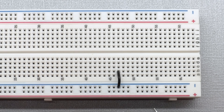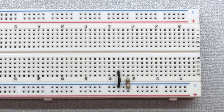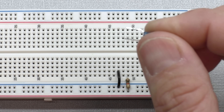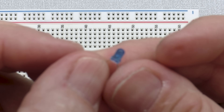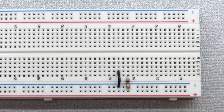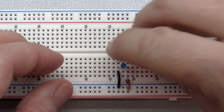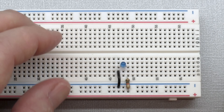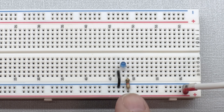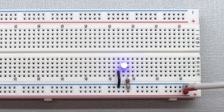You always want to run a resistor with an LED. Since we're using a 5V power supply, I chose a 1K resistor because that's more than enough to protect the LED. It's kind of hard to tell when an LED is burned out — you just have to test it and know. So I'm throwing that one away and bringing in a brand new LED. It's not a big deal if you accidentally install it backwards — it just doesn't come on. Turn it around and it works properly.